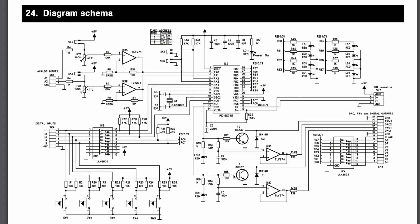Before we start to solder, let's have a look at the schematic so we have a basic understanding of what we're building. When you're new to electronics, always look at the schematic — you will always learn something. The heart of the system is the PIC 16C745 microcontroller. We see the USB coming in, decoded by this PIC. We have some amplification and attenuation circuits — I think it's 10x — going into RA0 and RA1, the analog inputs, and we can set the attenuation.